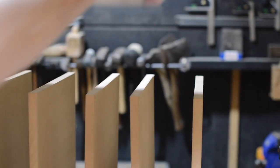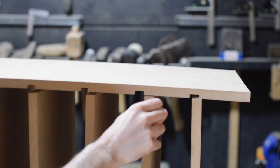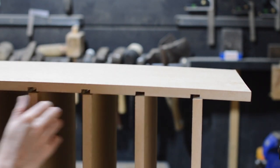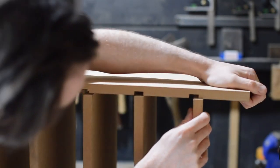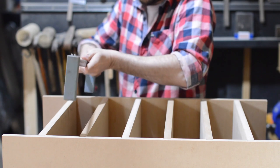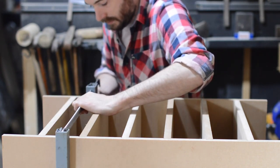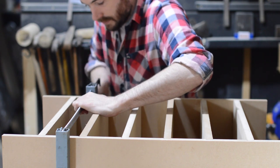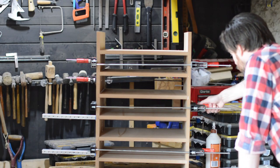The other side goes on and you've just got to line everything up, then I can get some clamps on to hold everything together. I'm not going to use any fastenings at all on the shelves — they're just going to get glued and go into these little dados. I got some clamps on the front and the back to hold it all together and then just left it a couple of hours to set up before moving on.